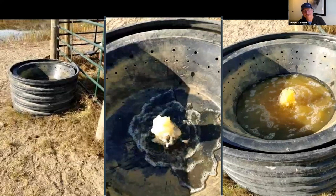Capacity depends on cloudy days and how much the cows are drinking, plus how much energy it takes to lift water. This particular system is only about 16 feet deep, which makes it more reasonable in cost. Systems are quite reasonable at 14 to 16 feet of lift; once you go above that, the pump costs go up dramatically. Phil suspects you could water 100 head on it but can't guarantee it.